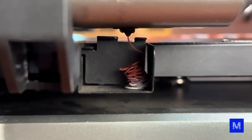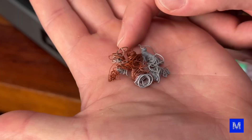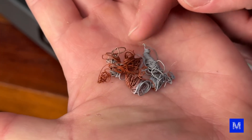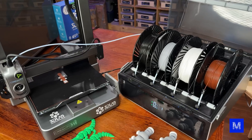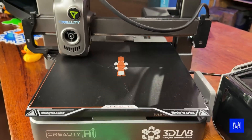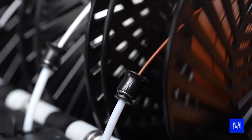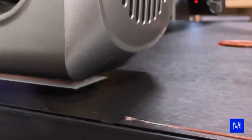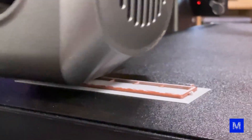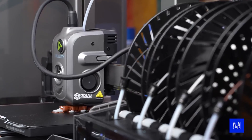That purge blob is just to remove the color it won't use again, then it continues with gray. Looking at the blob from the printer, it starts gray at the bottom and turns brown on top — or the opposite — since it keeps changing color. This has two consequences: first, you'll use slightly more filament than before; and second, printing takes longer because of the time needed to change the filament. Another thing that uses some filament is the tower built on the side, to release extra plastic and prepare the nozzle so it prints smoothly.